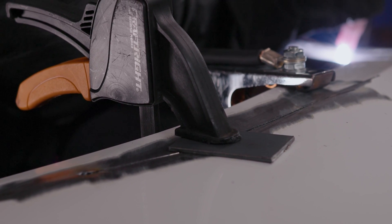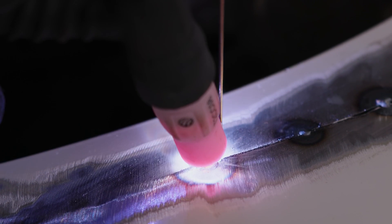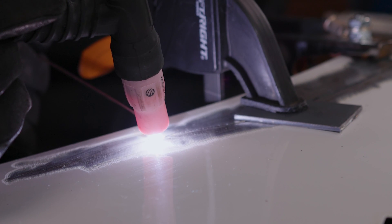Once you're set up and ready with your metal clamped into place, you can start your TIG welding. The first thing you want to do differently is your tacks — you want a lot of tacks, like a lot. Making regular tacks roughly every five to ten millimeters seems like overkill, but it'll keep everything where it's meant to be once you start properly welding. If your tacks are too far apart, your metal sheets will begin to pull away from each other, or one side could rise higher than the other — even beginning to overlap on a butt weld. When making tacks, add as little filler rod as possible, aiming for more of a fusion weld, so there isn't a big lump of metal in the way when you go back over them.